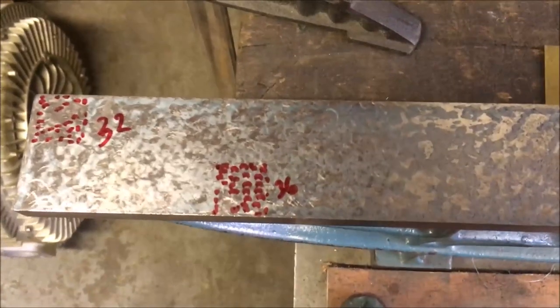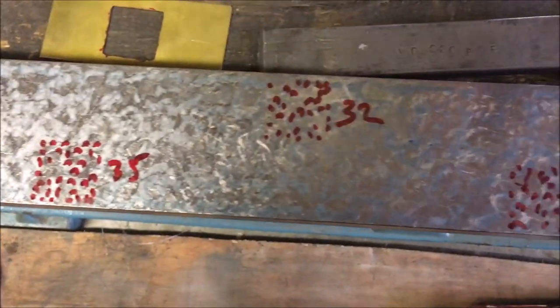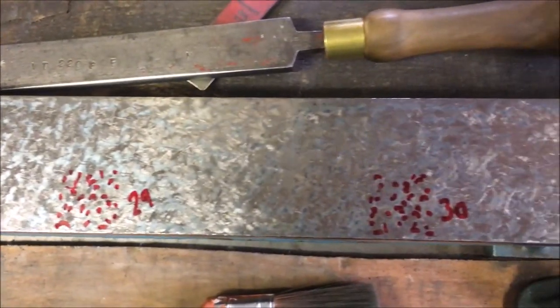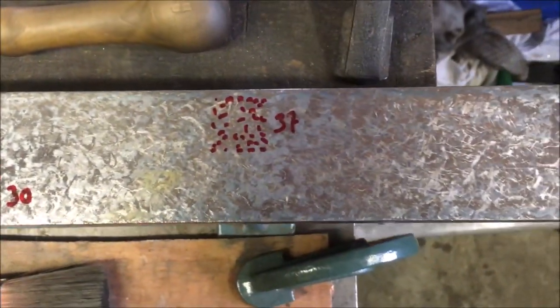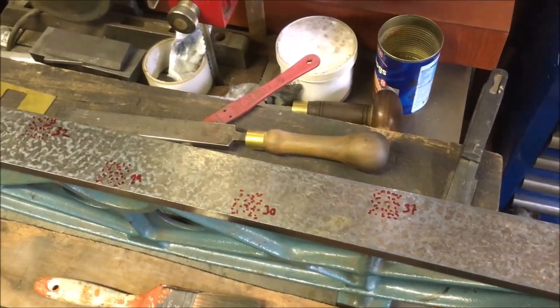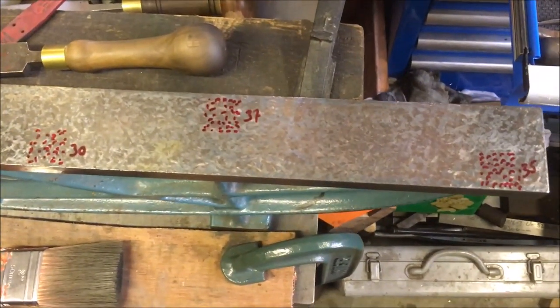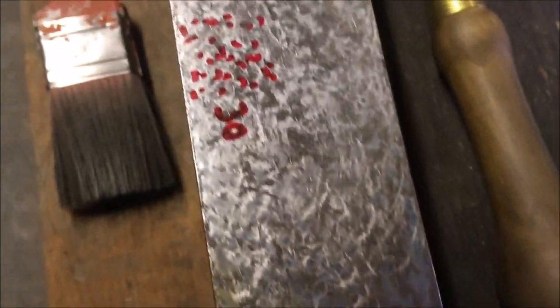Well, that's me done. I've got it up above 30 points. It's taken a lot of messing about with just trying to get a smaller curl with a scraper that I can use. And then trying to get the ink spread usable. What I've ended up doing is taking a print off the plate and then cleaning the plate and then rubbing the printed surface back on the plate and then knocking off those little black shiny spots, and that's taken it down. A bit of a faff, but I'm happy that it'll do the job now. It's not the prettiest of scrapes. That's me smudging the bit of crap earlier.